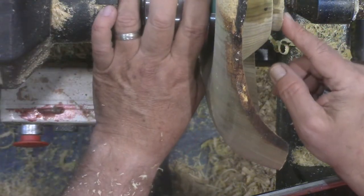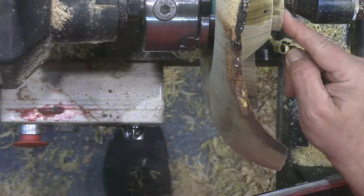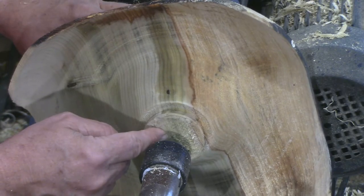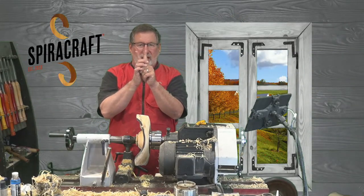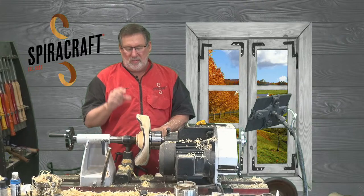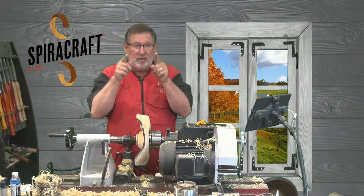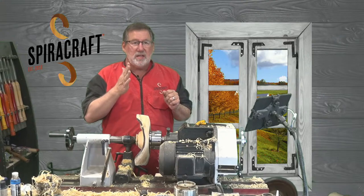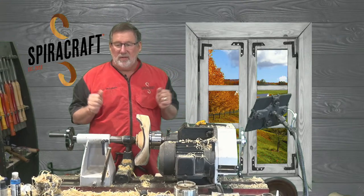So if I show you here, imagine carving this tenon in. I'll pop back over here till you've made just a little teeny cone, down to like a pencil tip and the size of a pencil, maybe 3/4 inch up at the biggest end. Carve that down to a little cone and then stop, and then you cut that off with a chisel, and then you stand it up, and that's all there is to it.